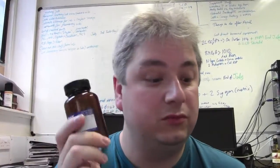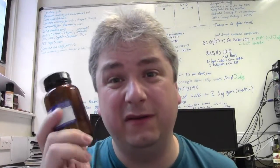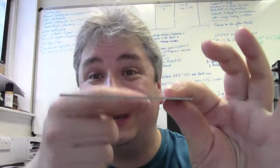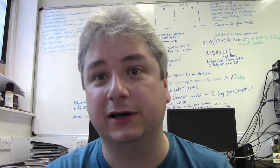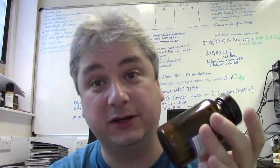It's a very very thin layer so you can put your components through the holes. The drawback is it's very very easy to break this stuff in the holes when putting components in or cleaning the board afterwards. We're talking microns of copper connecting on the edge through the hole between top and bottom — so it doesn't take much to break that bond. Over time this stuff will break down, go granulated, and can crack in the holes — especially if your board is under a lot of tension.